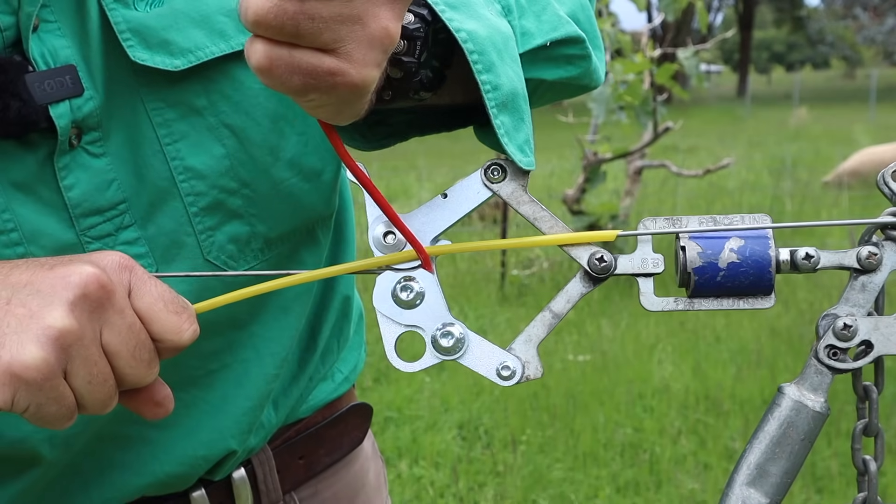So it's time to find out how our knot performs under tension. And for that we've got the fenceday test bench. The wire with the knot in it is attached at each end with a spiral fast, because they're just as strong as the wire. Up at this end, I've got a lever that I jack out using a bottle jack with a set of crane scales attached that I'm recording with this camera here. So we've got our plain wire set up on the test bench. We'll get our baseline of unbroken wire to begin with, then we'll put the knot on and we'll see how the two compare. Let's get started. Plain wire baseline — we do this every time because wire acts differently at different temperatures and different rolls can have slightly different results.